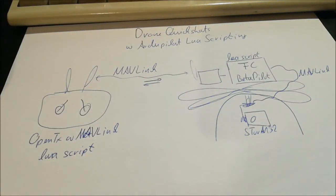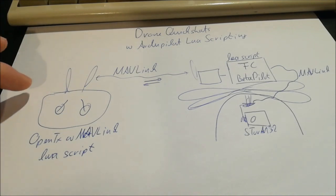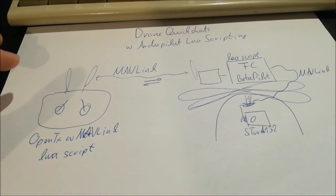So I just took the one which has by far the largest memory available, the largest RAM. And it's also sadly that ArduPilot is not really looking carefully at the RAM consumption, so it's not too difficult to configure an F4 to behave in weird ways or even to crash because of RAM limitations. So I just took an H7, and an H7 is also by far the fastest. I mean, an F7 is not very much faster than an F4, but an H7 is much faster. So I just took an H7 to have no issues with all the scripts.